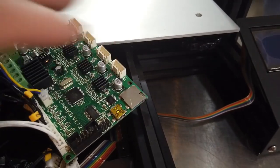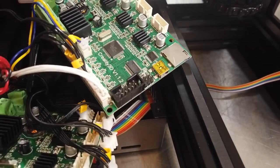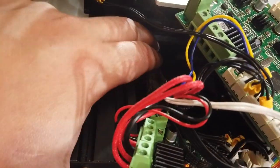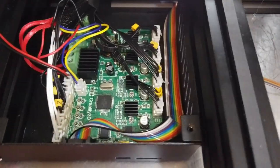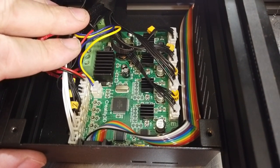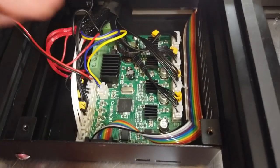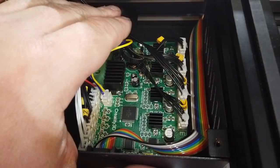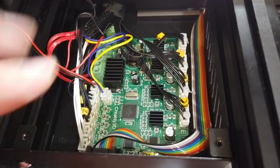It's a lot easier, and then you can slowly one by one migrate the wires over to the new board. These are pretty easy — XYZE — so you can just disconnect those because they all have little tags on them, making it really surprisingly easy to do. Just pull that wiring harness through the opening; there's enough slack to give you a pretty decent pull. The trickiest one is the power wire since it has the least amount of give. What I do is get the power wire in position and push the board into the power wire while it's pulled out. Then you push that harness back through the opening and lay your board inside and make the rest of your connections.